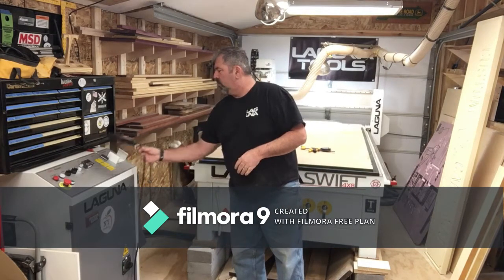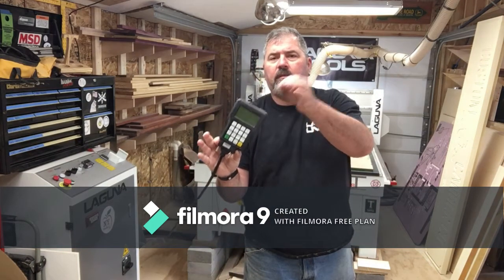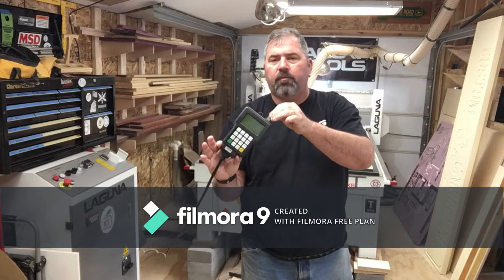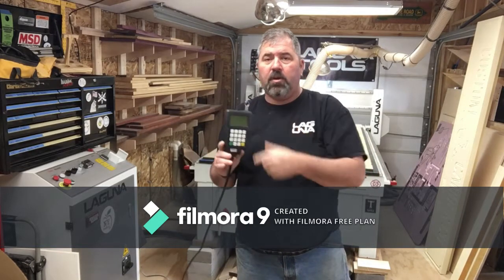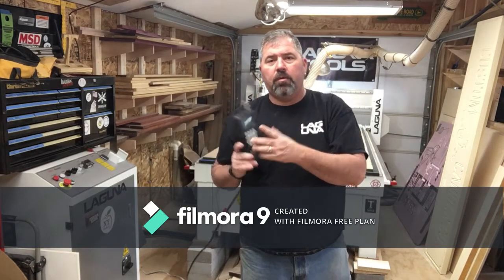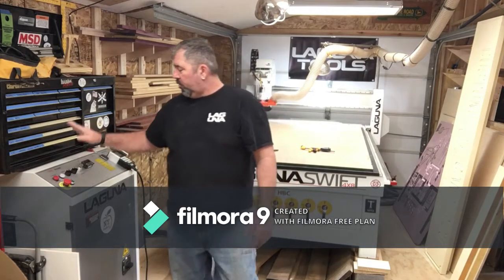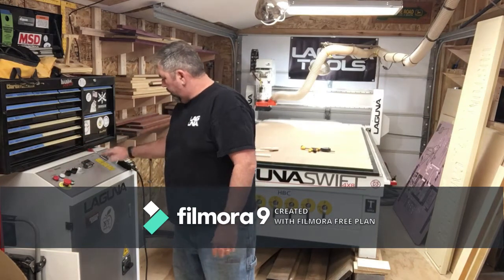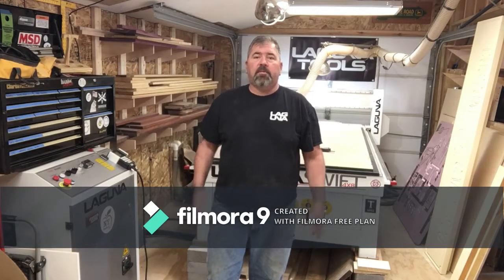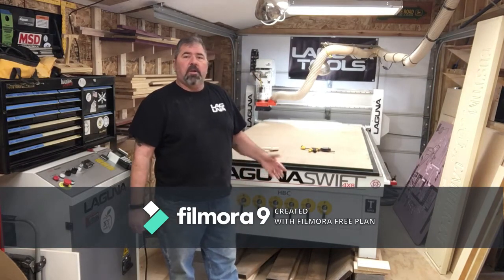This is the controller for the router, for the CNC. And this is literally a USB thumb drive. So you put your files from your computer that you design in VCarve Pro, in my case. You plug them in here, and then you tell the CNC what files you want it to cut, how fast you want it to cut. You have your speed control, your vacuum control, and there's a zone map to tell you what area of vacuum you're turning on and off with these valves. So that's a quick overview.